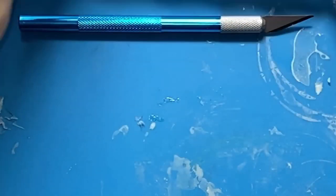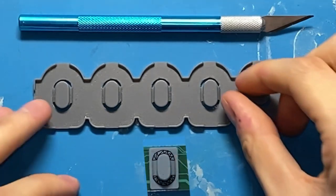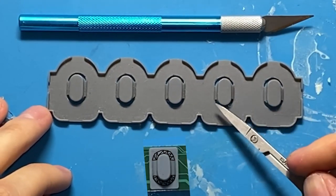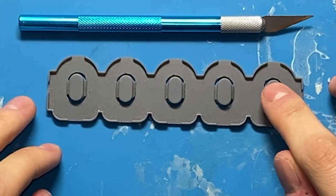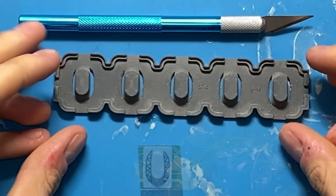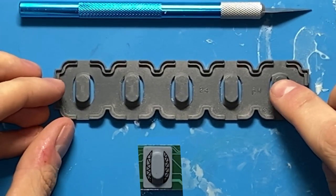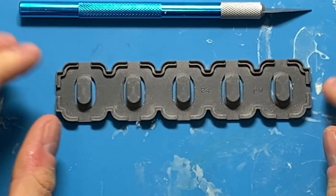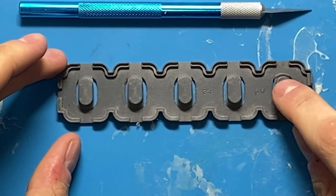Now there are a bunch of different ways that you can cut your pads, such as this, which is what I call bliss cut, or side cut, where you leave material on the sides like this. This gives you a bit more tactility while still keeping them relatively loose after they've been pressed. This is what I call tall cut, which is leaving the tops and bottoms. And this facilitates more tappy play. If you like to slide spam, this is probably what you're gonna do. But it definitely loosens them up quite a bit and still keeps the life of them pretty long.